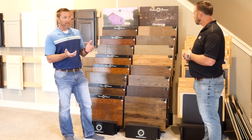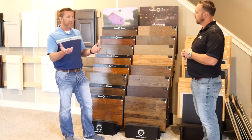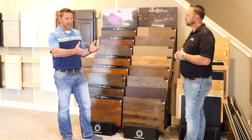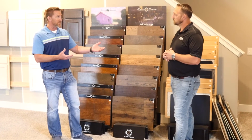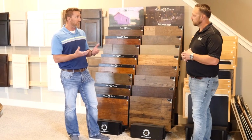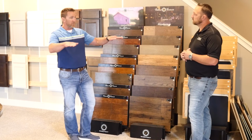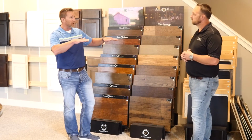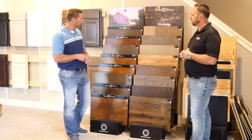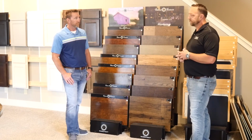Now, being out in the field, I remember years ago, you guys would be out there sanding floors, and during our production process, it was always kind of a nuisance when people would walk through a freshly sanded or freshly finished floor. And so the overall time to install is cut down by that, and it's more consistent, correct? Yeah. I remember there would be floors you guys would sand and apply finish to, and some areas would be darker, or back then we were using the oak tones, and some would look red and orange. Some of it is subject to the actual wood itself, and some of those woods take stain a little bit differently.